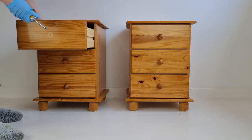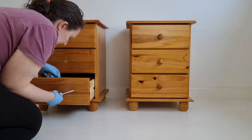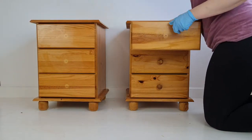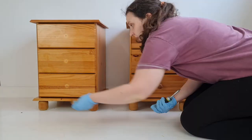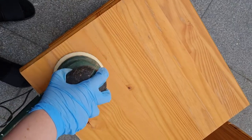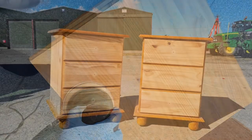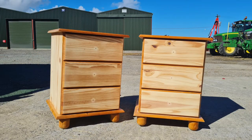Anyway, I'm taking off the handles here, and I made sure to wipe down all of the sugar soap residue. Then I'm just going in with my orbital sander once it's all completely dried. As you can see, when they're sanded back they look much nicer — much less yellowy.